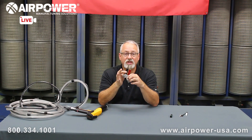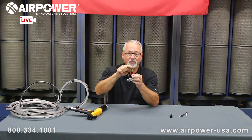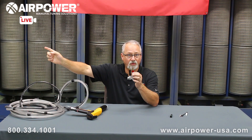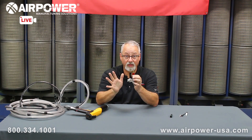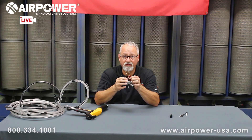Inside these check valves are membranes. They prevent powder from going back up through the red and black hose to the controller — we want that to be eliminated. So we pull these apart and change those about every quarter. You can't really maintain them; they get dirty and full. That's all you can do is replace them, so about every quarter you want to replace those.